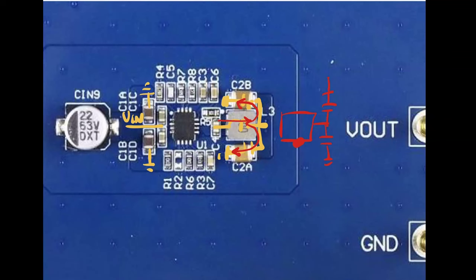As you talked about the coupling between the two magnetic components, is it a big problem when I put the input filter and the output filter close to each other? Yes. It's very, very important. Typically, it's not considered. Many designers that are not familiar with high frequency effects don't believe this coupling until they see how important it is. Every time you have inductors, including inductors with closed cores like toroids, they are really good creators of magnetic field through leakage, or they can attract a magnetic field very easily. So it's impressive how you can destroy the efficiency of a filter or a system with this kind of location.